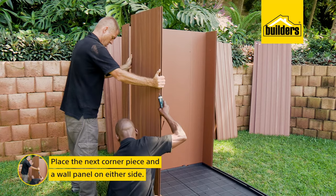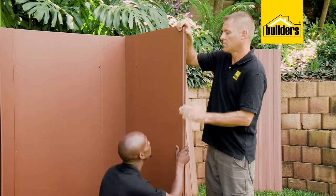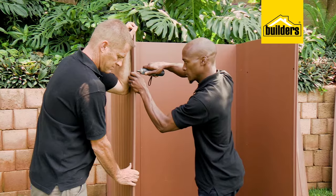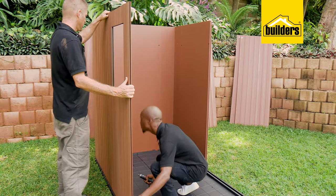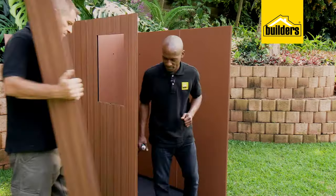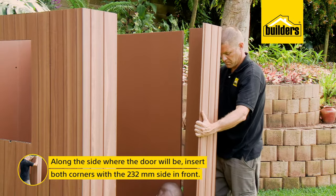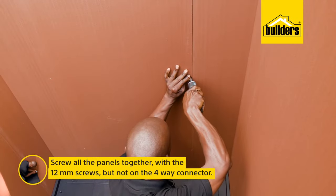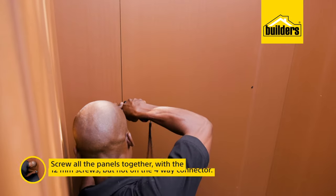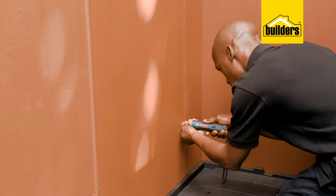Next is a corner and a wall panel on either side until you reach the middle, securing the top screws as you go. Here we need to put in a 4-way connector strip, ensuring the large side faces inward. The window can be placed on any of the two sides or the back panel. Work your way around until you have the walls done. Along the side where the door will be, we need the shorter 232mm side to be on the front to allow for the door frame. Finish screwing all the panels together using the 12mm screws, but not on the 4-way connector — we'll get to these later. Make sure each piece is tightly pressed together and down onto the base.